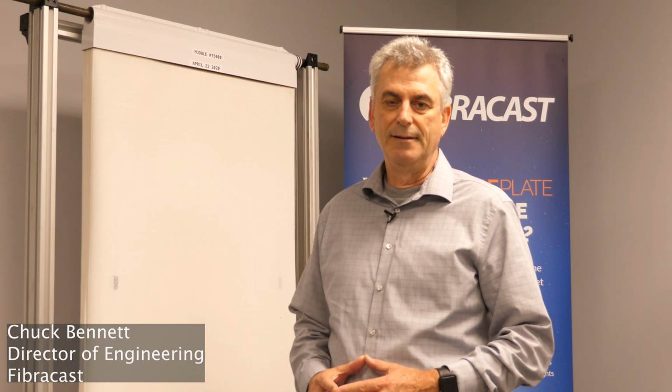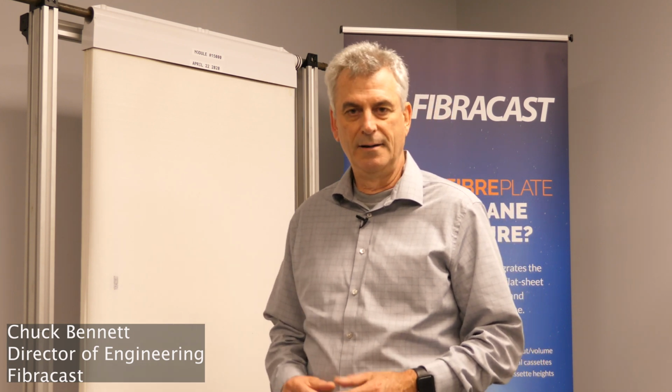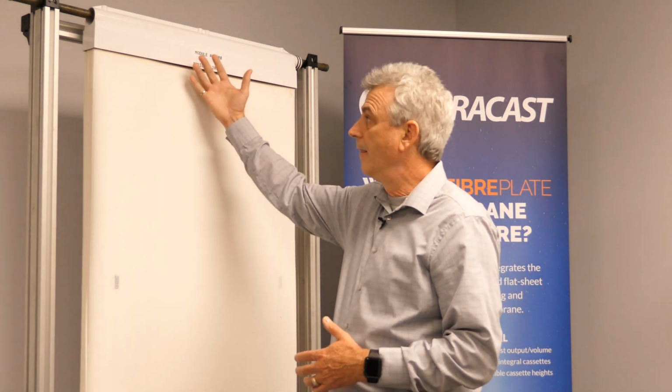Hello, my name is Chuck Bennett. I'm the Director of Systems Engineering at Fibracast. The biggest problem we've seen in the industry over the last few years is that they still struggle with solids handling, debris, and costs. The problem with the vertical orientation is the air is trying to come up in the water, and the water is coming through the membrane, and they're colliding into each other. It's creating turbulence, but they're not working together. As well, the solids are being lifted up through the membranes, and they're getting caught in these obstructions that are in the way. Here at Fibracast, we solve those.